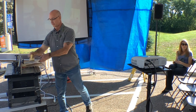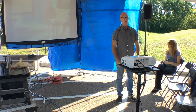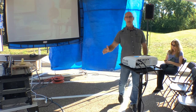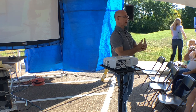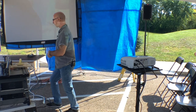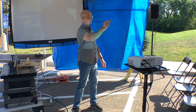George, another question for you. When would you have buried the bit in the fence? It's a great question. So sometimes you want to slide the infeed fence over and cover, bury part of the bit. That's called zero clearancing your fence. We'll see how things go later. I may or may not do it with this bit when we do the next joint.